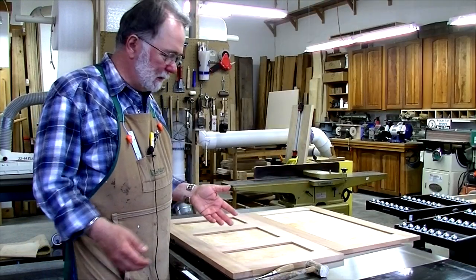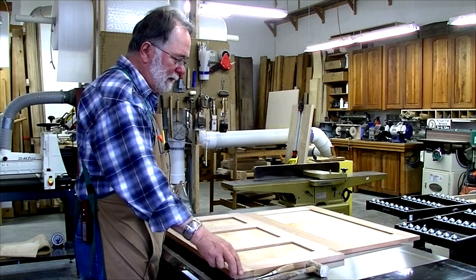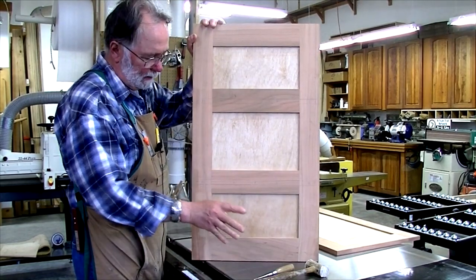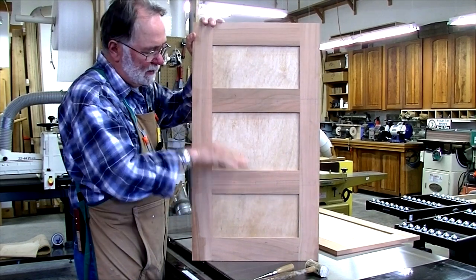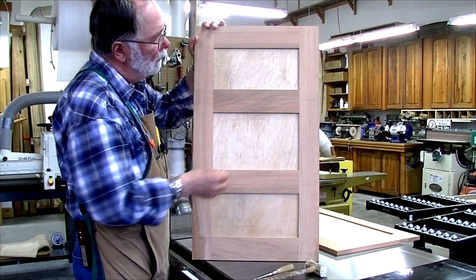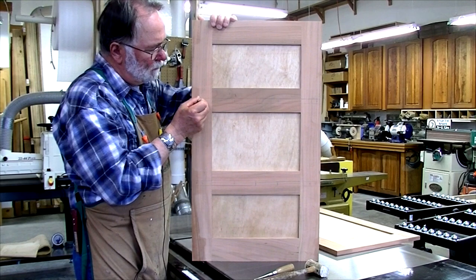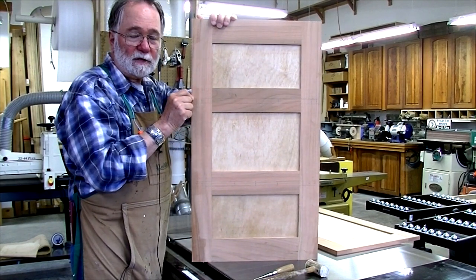The cabinet is going to be held together with dowels. Here's the vertical panel that's in the center, and the three big drawers are on either side of this panel. The dust dividers come out like this, and I'm going to dowel them with 2-inch long, 3/8-inch dowels going all the way through this vertical panel, which is about 3/4 of an inch thick.